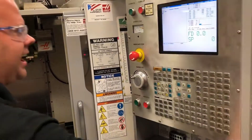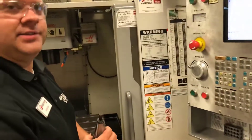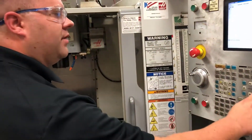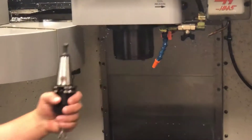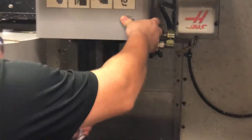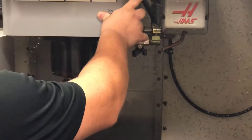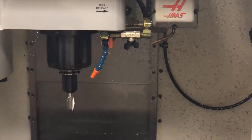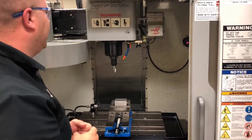I need to be in manual mode to be able to actuate my tool release button, so I will go into hand jog. It does not matter the orientation on this machine specifically as to which way it goes in. I will push and hold — that tells me that my machine clamp is unclamped. While holding upward pressure, I will let go. That means that my tool is secured — the draw bar has securely held it into the spindle.